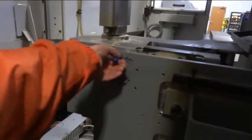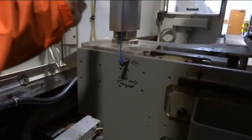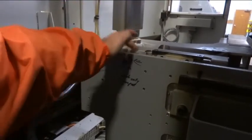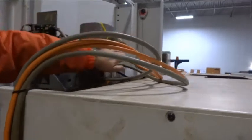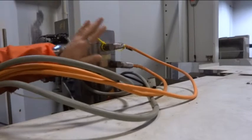However, we have a screw. Let's go on there, Jörg. This screw, I will put back in. This is to secure the tool changer from moving in and out during shipping. So this one will be in again to lock it in here. You can take the screw out so that the tool changer can move. The tool changer is also connected here on top. Let's go here. There is the motor here, and we take the wires off. It's the feedback cable from the motor, 1, 2, it's all marked. It only fits here, so it fits nowhere else.